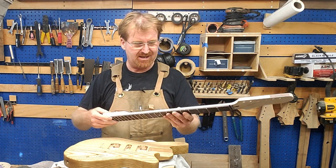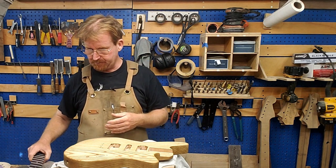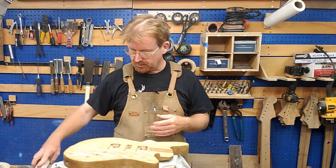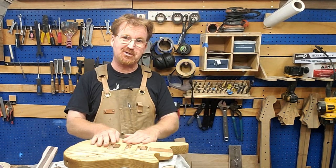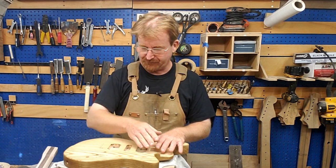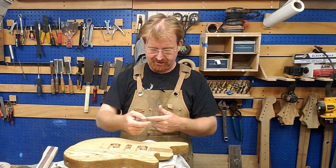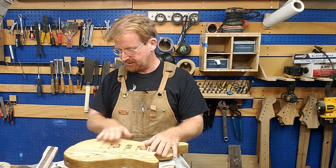That's the neck for it. I've got it all sanded, haven't got the neck oiled, but that's the only thing stopping me there. The sanding part is all done, at least we think, right? It always seems like you think your sanding is all done, nice and clean and ready, then you get that first layer and you start seeing what I call cat hairs. It's just the scratches that go the wrong direction. So then you gotta clean it up.